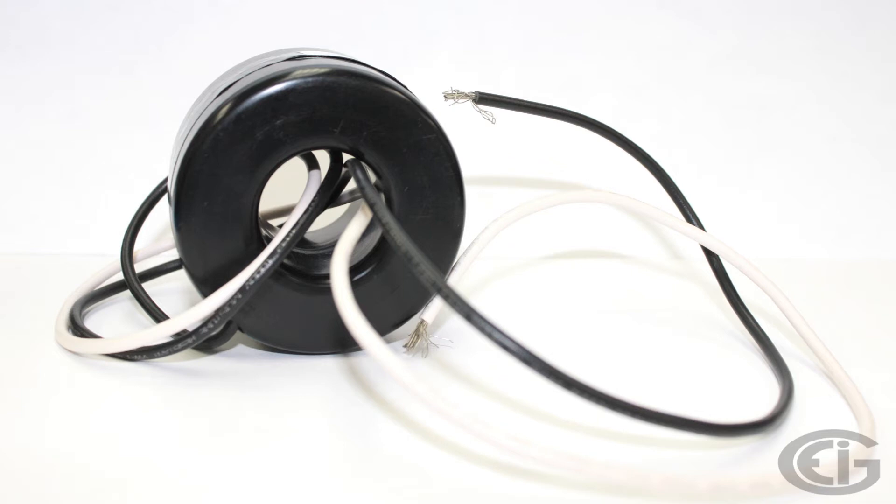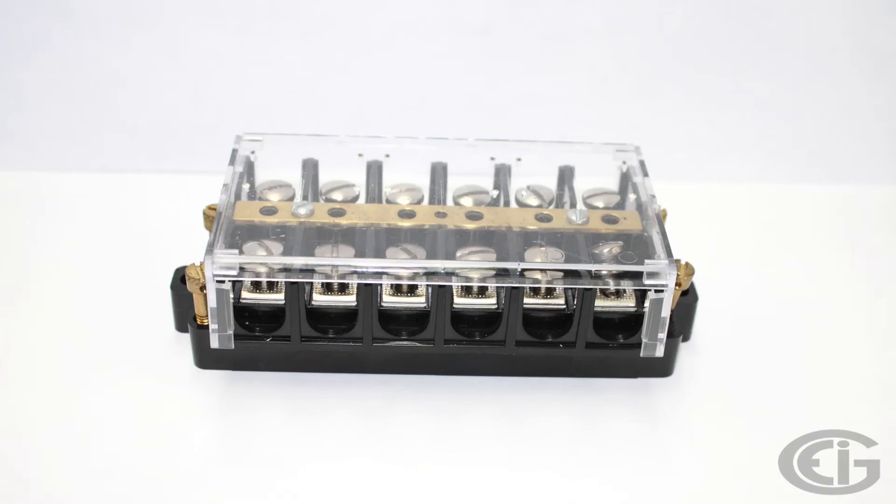So we would put the main through the center and point the high side away from the load. The next critical step is the connection to the meter. The white wire is the high side and black goes to the low side. Remember that CTs are always shorted when on a live circuit, so if you can't shut down the circuit to install or work on the meter, you will want to install a shorting block between the CT and the meter.